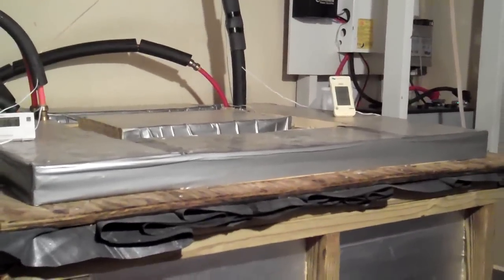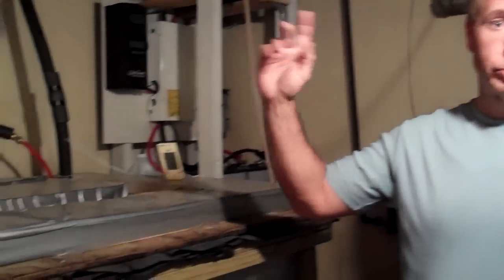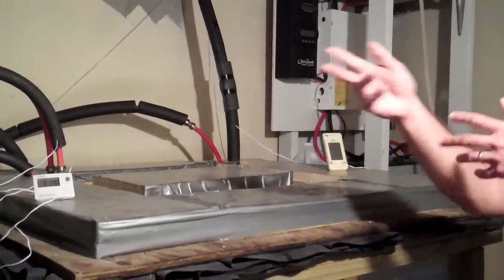Okay, this is our thermal storage tank. Now, before you start thinking, oh my gosh, I don't want anything like this in my house — you don't have to. You can do a lot with solar energy by simply taking the heat the moment it is generated, distributing it as hot air blown into the basement, or if you use a liquid system, you can just run it as underfloor radiant heat and right back out to the collector. You don't have to do a thermal storage tank. Where a thermal storage tank is beneficial is if you also want to do domestic hot water heating, or if you want to store heat for a longer period of time and distribute it a little more evenly.